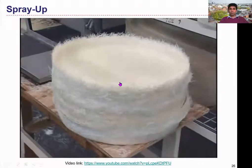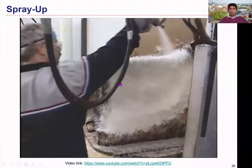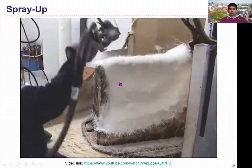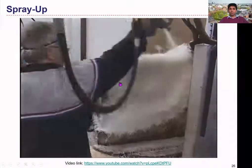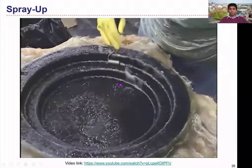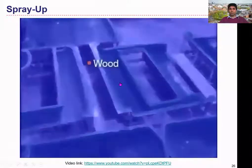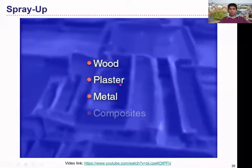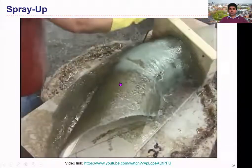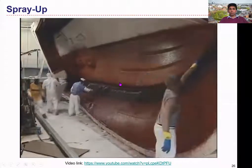The reinforcement may also be in the form of a fiber preform. These preforms are produced in several different manners, with the primary method being pre-shaping by spraying chopped reinforcement and binder onto a shaped screen form. Composite layups and spray-ups are produced using molds having the desired finished part shape. Molds are most commonly made of wood, plaster, metal, or composites, depending on the volume of parts and processing requirements such as temperature and pressure.